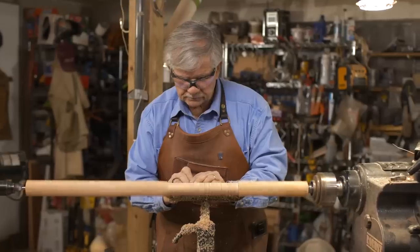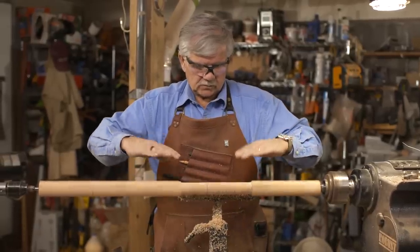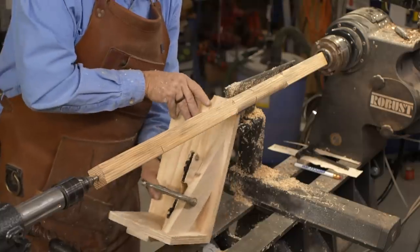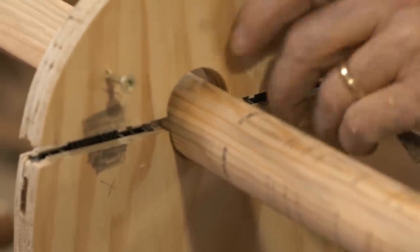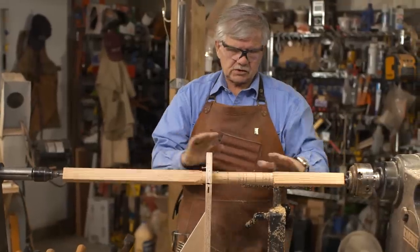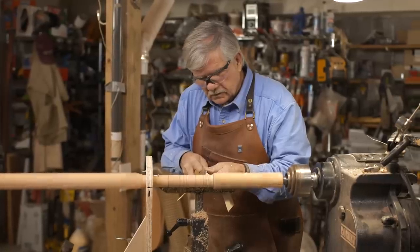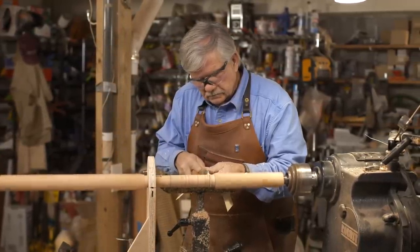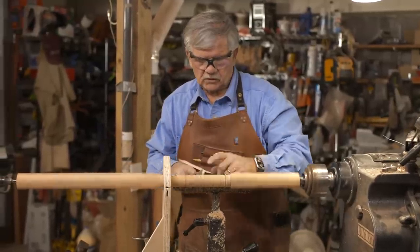When I was turning, I was getting harmonics — the piece moving up and down. So I want to steady that. I've made a steady rest jig that will sit right on my lathe. I take the other half of the circle, put it on here, and attach it to the lathe. That will lessen the chance of getting a grab and snapping the baluster in half. This section here is going to go deep, so I'll put a little mark.